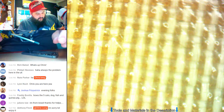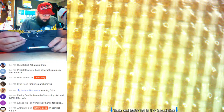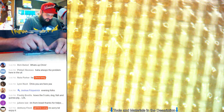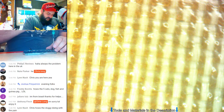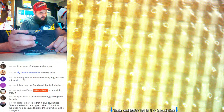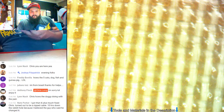Although TriStar does seem to be working properly, I have a feeling that TriStar may be causing part of our issues. So I'm going to replace TriStar first, since it is the only chip that talks directly with the USB devices, other than the CPU. The CPU kind of talks through TriStar, but hopefully it's just a bad TriStar.